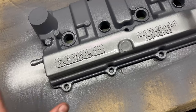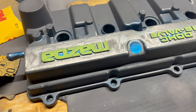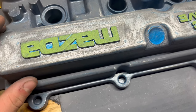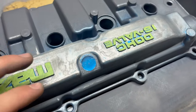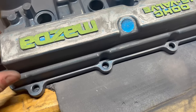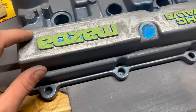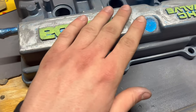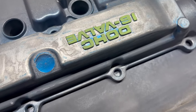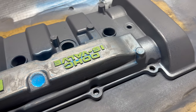I know I skipped a part or two here, but I did go ahead and get that anodized blue on there. I put tape over the lettering, let that dry for about a day or so, then went ahead and sanded off the rest of it. I had tried to primer over top of that and let me tell you it does not come out the best — so definitely sand down whatever color you're not keeping. I tried my best to get my knife in there to etch it away and it came out pretty decent.